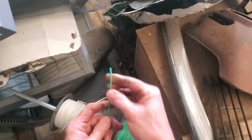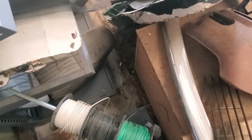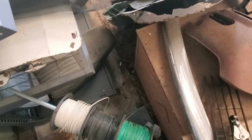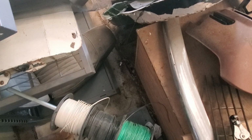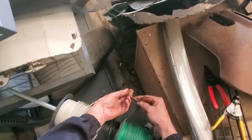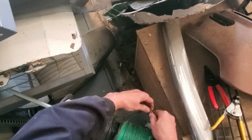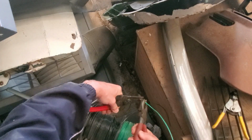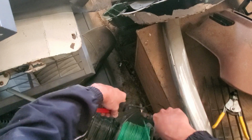Okay, I have my 3 spools set up here, THHN single strand and solid core, I guess you'd call it. And I'm going to strip and attach all 3 to the fish tape. I'm going to stagger the joints. So I'm going to try to bring the diameter of this knot of cable up slowly. The shortest will be the ground. I don't want these coming off inside the conduit and losing 50 feet of each wire.